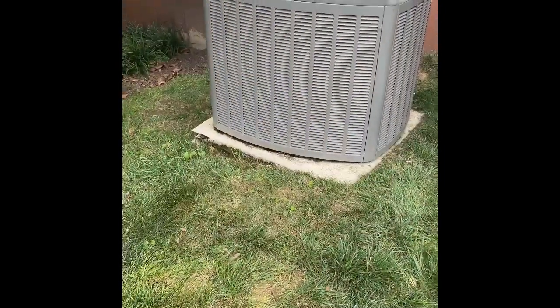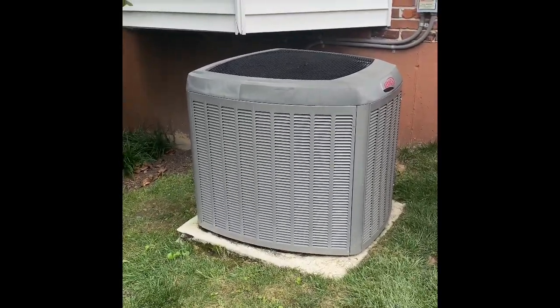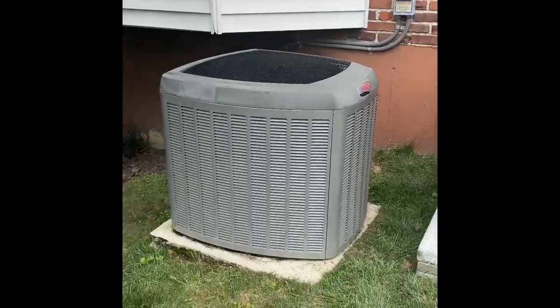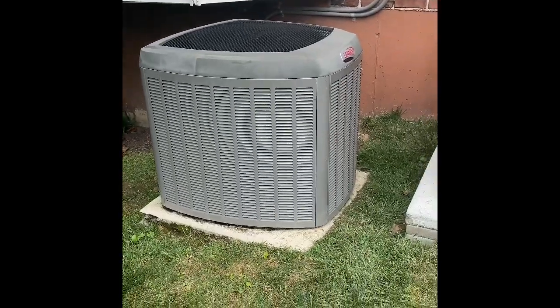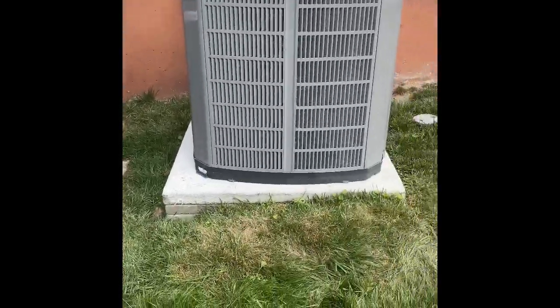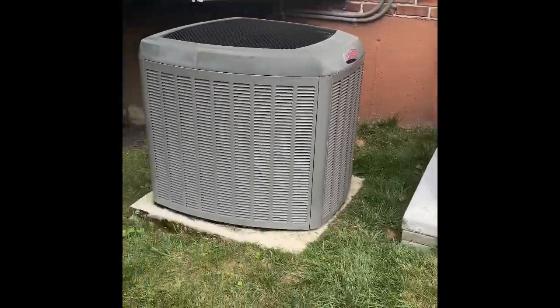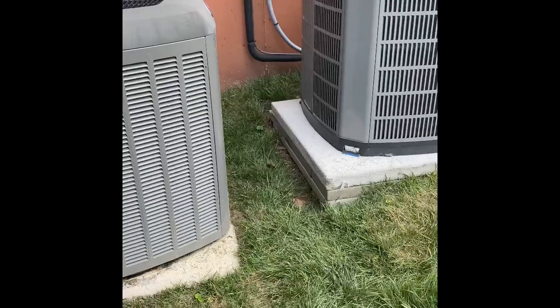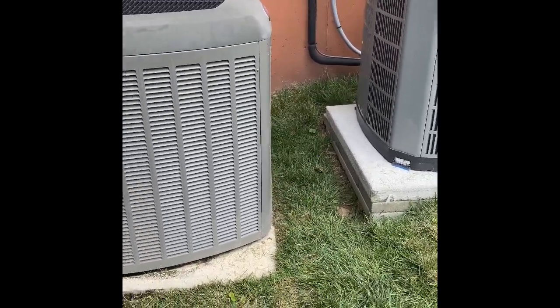Here's our heat pump outside. We'll put our new heat pump in the existing location. We'll do a new disconnect box and electrical whip, and flush and pressure test the line set. We're going to do a new pad — we'll have to set the pads up kind of like how we did this one, so a new pad down, bringing probably four to six pavers to get everything nice and level.